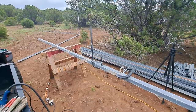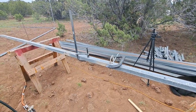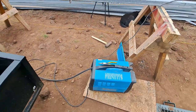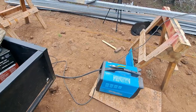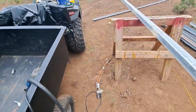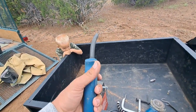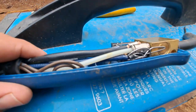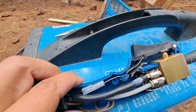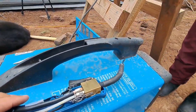I'm about halfway through my first piece and my welder that I've had for 18 years — something's malfunctioning. The wire is not feeding through the gun quite well. Check it out — all that wire. That's my welding wire; it is all bunched up in there. So if I can get that out and get the wire running through the gun again, hopefully we'll be good to go.